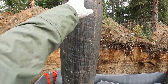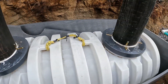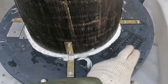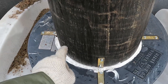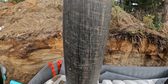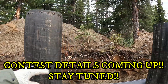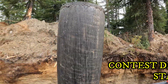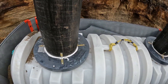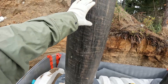I put this dewatering pipe in and opened up the port on the top two sections of my tank, then put angle brackets all the way around to keep it secure. I used heavy 100% silicone to keep any water or dirt from getting inside the tank. A veteran plumber told me to do this. With these two ports open, if I ever need my tank sucked out, it's easily accessed by a pumper truck.